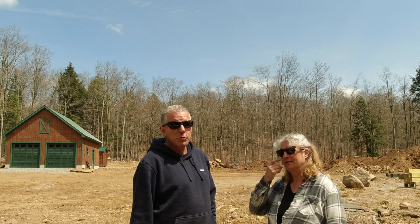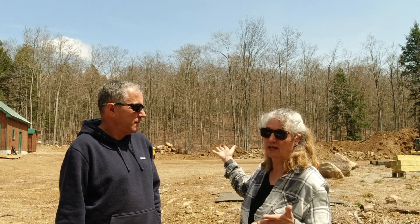Now we're going to bring in another 18 inches of stone on top of that. First they're going to do the forms, then bring in the stone, and then next week or the week after would be cement — hopefully we'll be pouring. We can't do the foundation ourselves because it's so detailed and intricate, but stay tuned because we are DIYing when we put the steel up and all the rebar, and even a lot of the framing, because we're really trying to save on our budget.